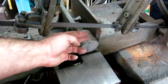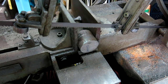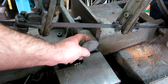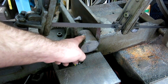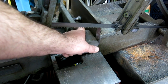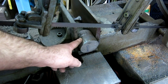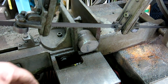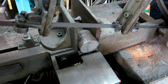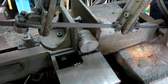Now we could take a little slice off that and be confident it's not going to squirt out or do something obnoxious. The other thing you can do: if you're down to your last bit of material and you really need to slice three more pieces off, you can weld something on the other side to hold on to, and actually cut all the way to the end to get maximum use out of the material. Anyway, that's packing blocks, guys — make sure you understand when and how to use them. Thanks for watching!